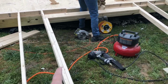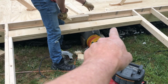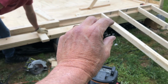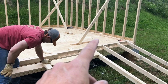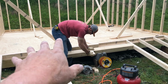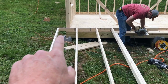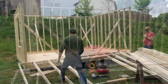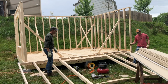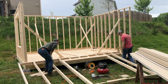We'll put these doors in. We went with 79 inches high and put the two 2x6s sandwiched with a little piece of siding in there to make it 3.5 inches. And because the other 3 walls are installed, we had to build it as much as we could on the decking, and then we pulled it off the edge onto the ground and put in the last few pieces. And then we'll stand this wall up. Come in here in the middle, closer to the middle frame. Stand in the middle. There you go, right there. Stand in the window. Right here.